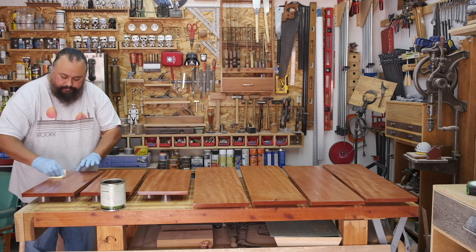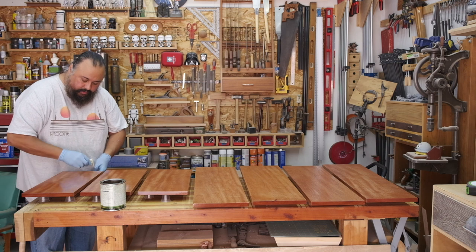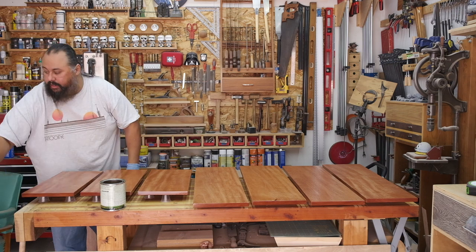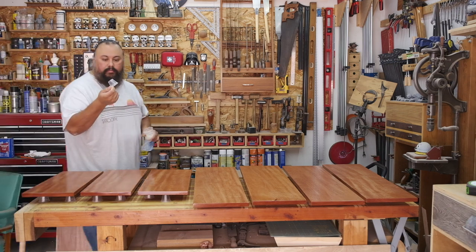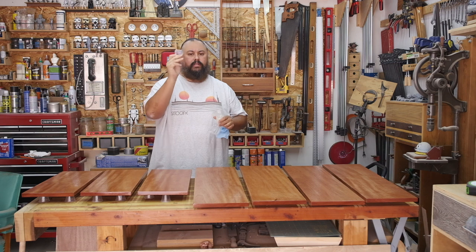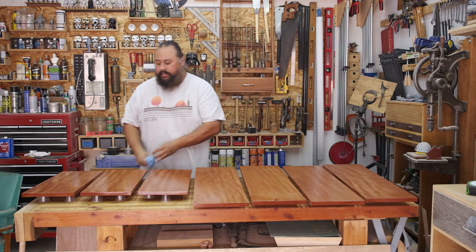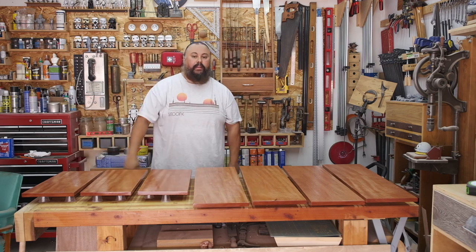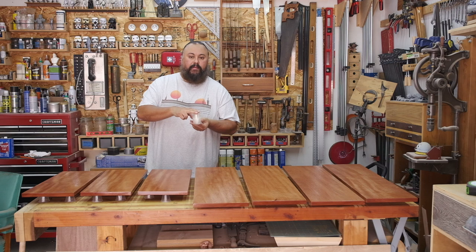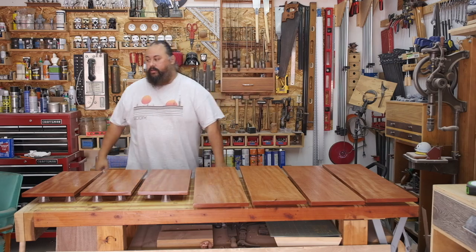So the way I solved it, and I actually like them better, I'll show you in a second. Let me just finish this last one. I don't know if you can see it from over there, but I've been using plastic measuring cups. This is a 1 ounce cup. I'll buy a bag of like 100 of them from Amazon for pennies, and they work great. They're perfect little standoffs. They're not necessarily better than the painter triangles because those have a bigger area, but when the back doesn't matter as much, or you're doing one side at a time, these are great.